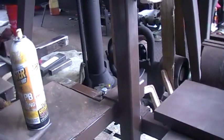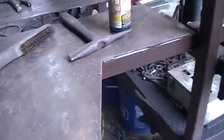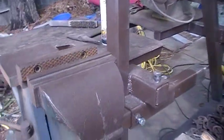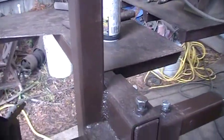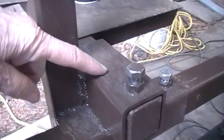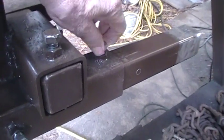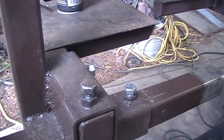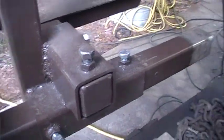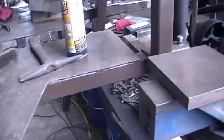I had a half-ton truck and the receiver was rated at 500 pounds, so I figure these will easily hold 500 pounds. My little workbench with the six-inch vise probably only weighs 50 or 60 pounds. I made them starting at six inches, with the underneath one at eight inches for extra tightening room. The two-inch tubing that slides in I made a little extra long — started at 28 inches and went up to about 32 — so you can slide them in and out.